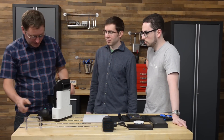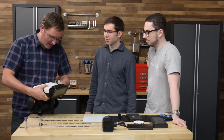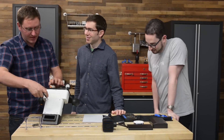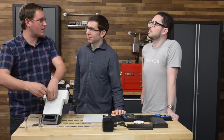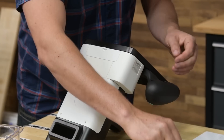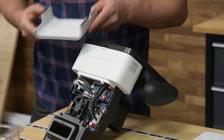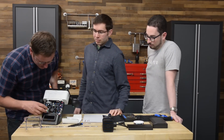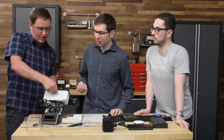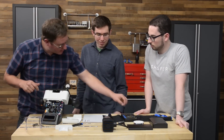This cover comes off. I haven't given any thought ahead of time to how this thing comes apart — I think I'm going to start with the back. What's your favorite Torx size? T6 is the most common size used on cell phones today, so that's probably our favorite. Back plate — there we go. We can take the sawdust guard out, and now we've got larger Torx screws.